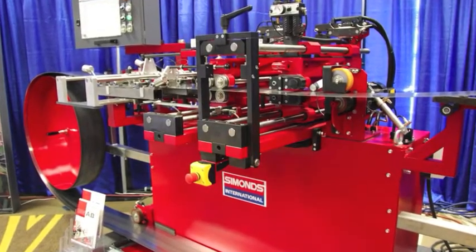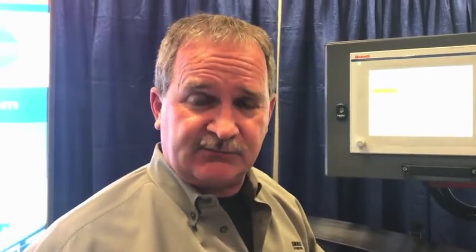This is our latest generation automatic benching machine, and it automatically has measurements on it. It will map what you've got on your saw for back, level, and tension, and it will replicate that for you as you save that on a record on the machine. So you actually put a blade up here that's been properly benched — it will map what you have on there for your specifications that were put in there by your skilled benchman. You load it in, you save that record, and now that becomes your benchmark, and the machine will always bring that saw back to that same level of condition.